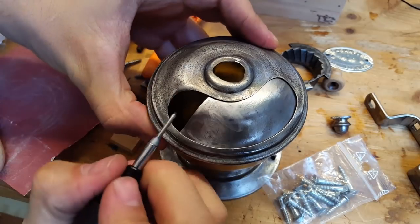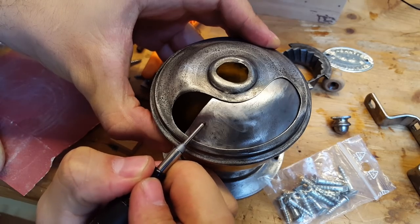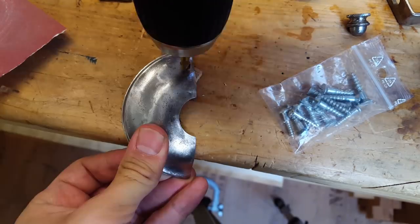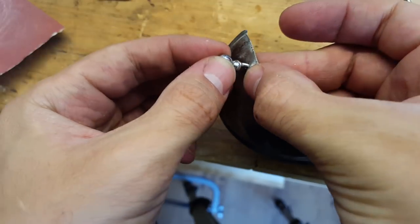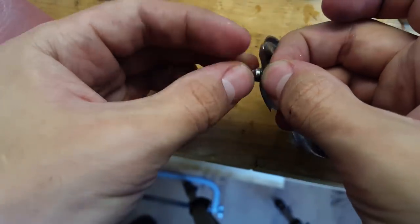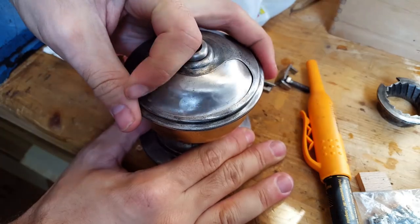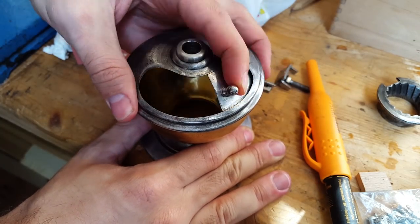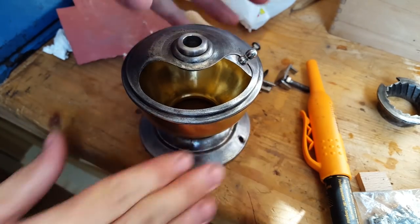I precision marked the spot where it would go and drilled a 2 mm hole in that position. I tried to avoid these invasive things the best I could, but this seemed to be the only way this time. With a little knob, the action of opening and closing finally worked. This meant that all metal parts were finally ready to receive their finish.